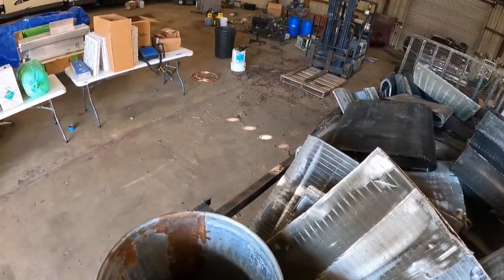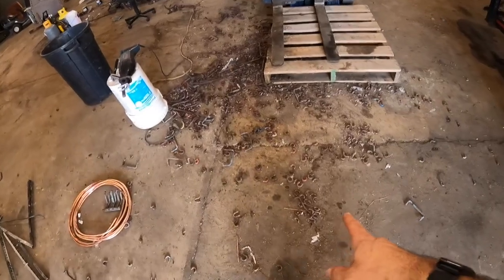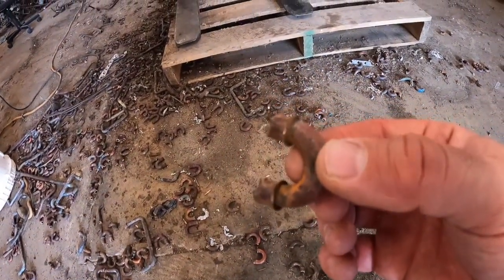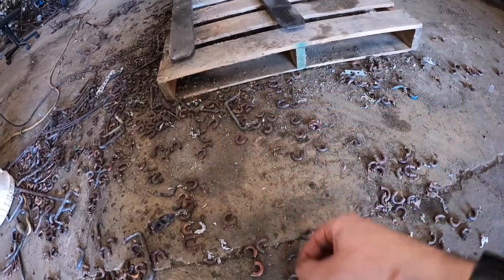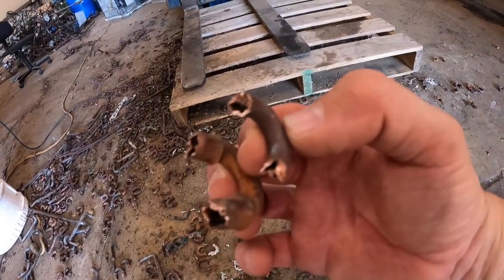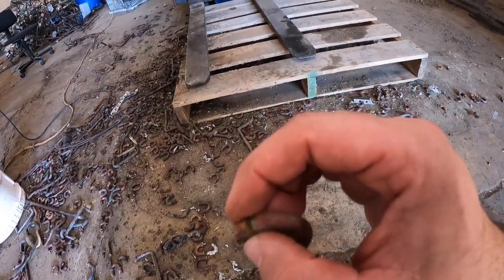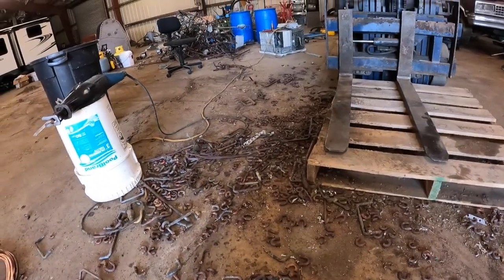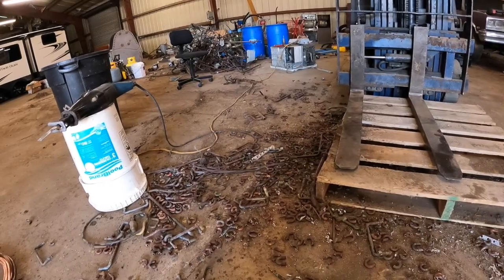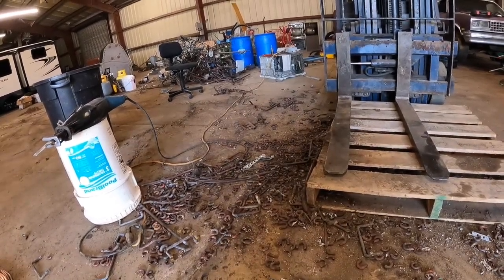We'll have to come through and get all of these pieces separated into number one and number two. Like this is a piece of number two because it has a braze joint in it, versus that being number one because it's just copper — you can kind of see the difference there. Got that little lip on this where it was brazed in at the factory. So we'll separate all of that into those blue tubs over there: number one, number two. We'll cut through all of this steel and brass, separate it into number one and number two, and brass and steel would be scrap metal. That'll get taken to the recycling vendor at a later time.